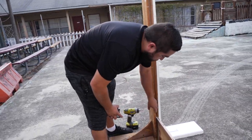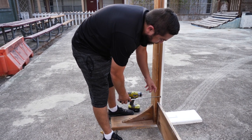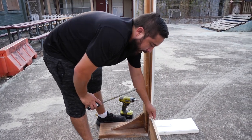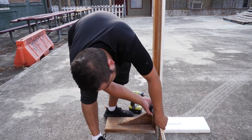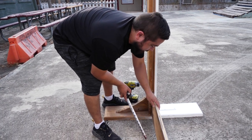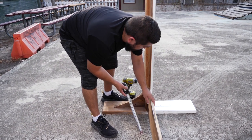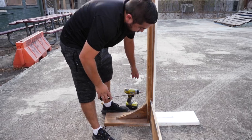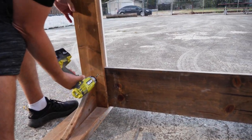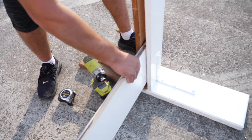So we have the gap here. There's about an inch gap. These are 3/4. They sell them at Home Depot as one. And these are 8, so they're 10. These are actually 9.5, but at Home Depot they'll say 1x10, but they're actually 3/4 by 9.5. And you can see, I just screw in this one. As you can see, this just slides right in and out.